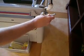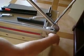This is the safety shield it comes with — it just goes on just like that. I'll take it off now to show you a few other things. This tool is for changing the angle of the blade. It goes into here, and you loosen this bolt up here. Once that's loose, with the blade halfway down, you can turn this by hand to change the angle of the blade. They come preset from the factory, but if it ever gets off, that's how you adjust it. Once you get it where you want, tighten it back down. You basically want this blade to hit the back end first, then be up about an eighth of an inch on the near end, and it will slowly go down and touch the whole thing.